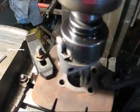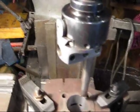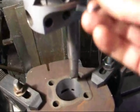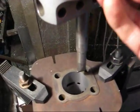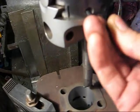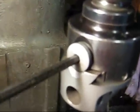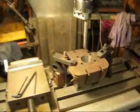Checker size looks good. Well, we just checked it, so let's take off a little more. According to my calipers and my depth mics, I've got five more thousandths to go.